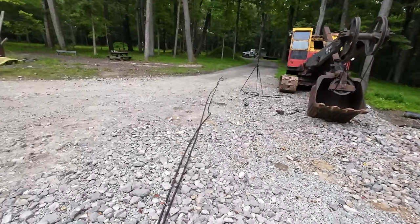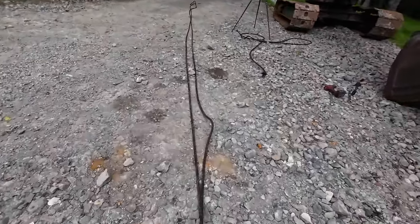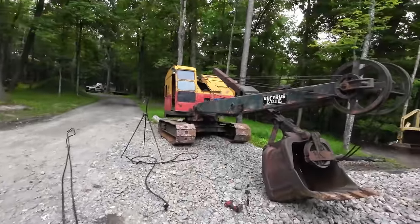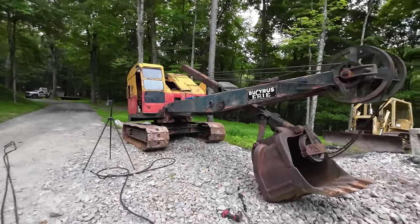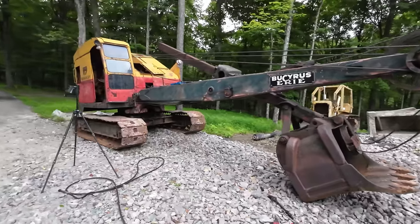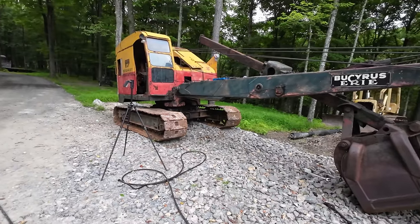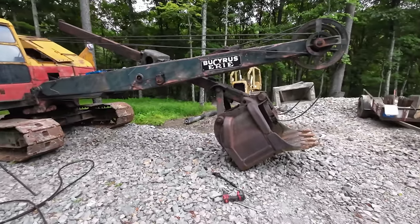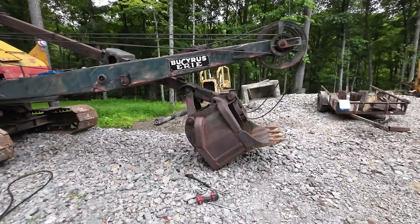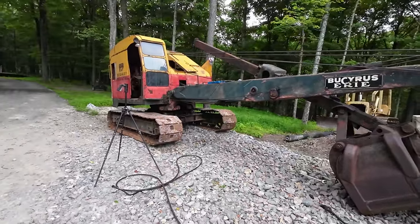This is the crowd out cable, which goes over the end of the stick. It basically doubles over. That kink is in the middle of the cable, at the end of the stick. And then each side goes back over the shipper shaft there at the pivot point and back to each side of the drum. And then we get this one hooked up first and basically tension it up with the machine. And then the retract cable is just a single part that goes from the bucket end of the stick over the top of the shipper shaft back down to the drum.